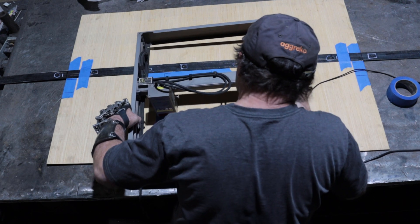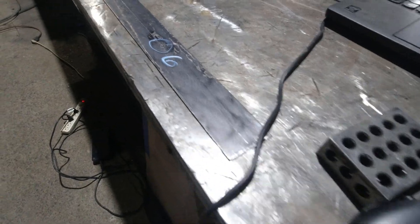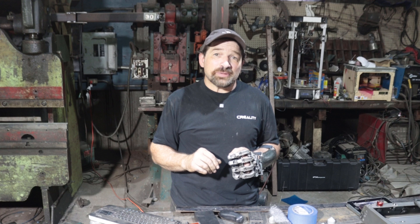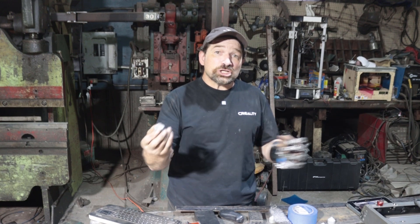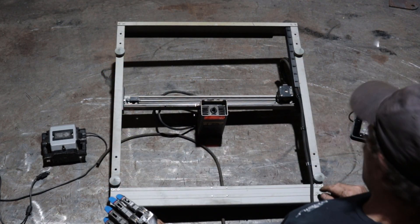I'm able to accomplish this by manually indexing the machine on the material being cut. I use a piece of inch and a half wide flat bar that has a series of holes spaced at 380 millimeters. I could have spaced them closer to 400, but most of the parts I engrave or cut are divisible by 15 inches. This setup also requires a set of four 3D printed cones that slip over the rubber feet of the machine, threaded into the holes closest to the control panel on both the front and rear set of mounting points.